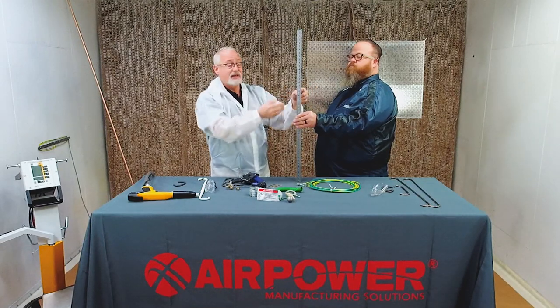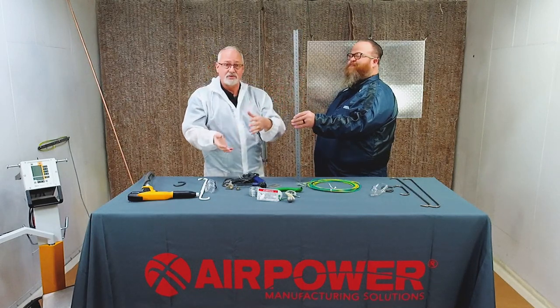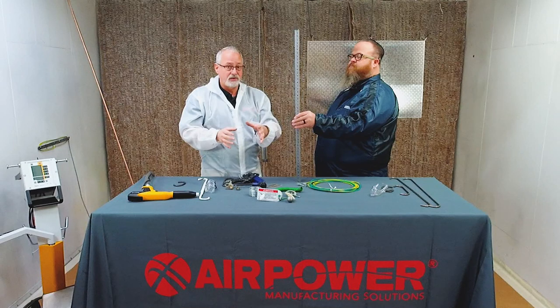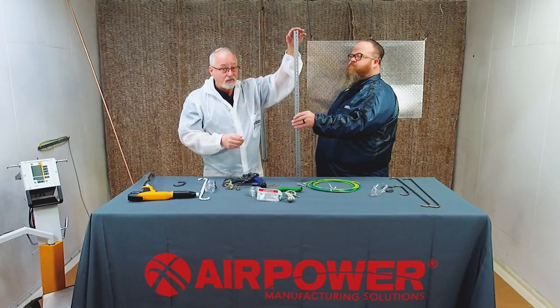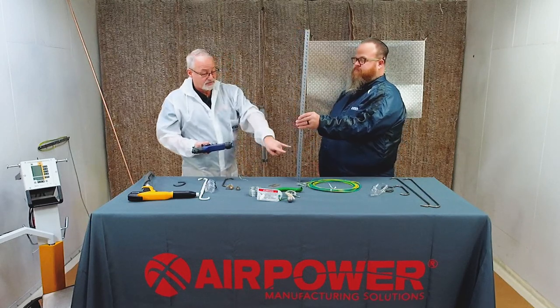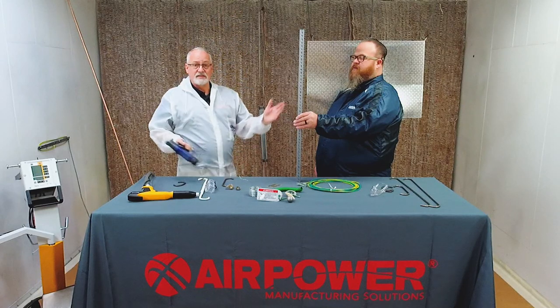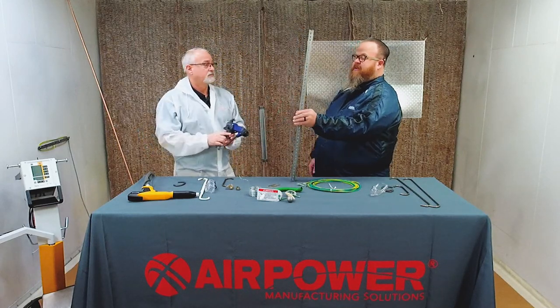Non-electrostatic, you have to paint each side, you have to paint inside the holes, you have to paint the edges. You don't have to worry about edges with electrostatic. Train your operators not to do that because they don't have to paint an edge ever. It gets attracted to it. So if my fan pattern was this way with my gun held this way, that's done, right? But then the other side is already finished.